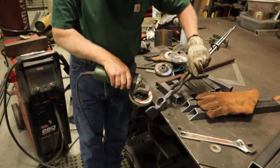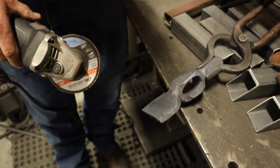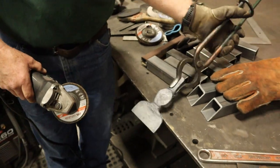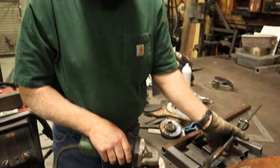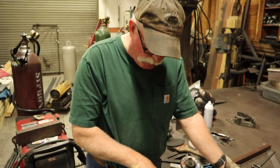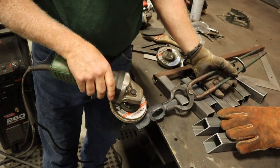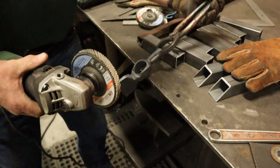I'm getting ready to get rid of these cold shuts on the side — I've got a couple right there. Because they're superficial, I'm going to go ahead and grind them off so they're out of the way. Normally you get cold shuts because you hammer something too thick too quick and it starts to fold over — that's what a cold shut does. Because these aren't deep and I have plenty of meat here, I'm just going to take a grinder and dress those off a little bit to get them out of the way.